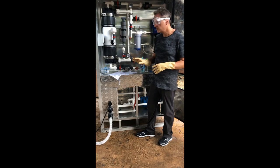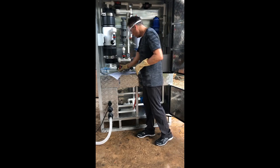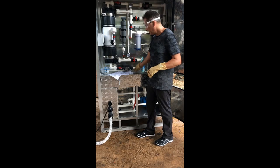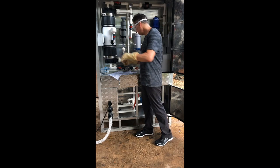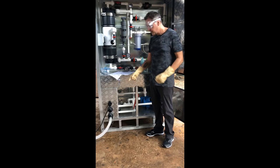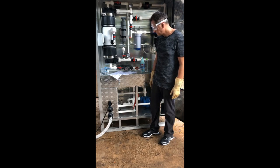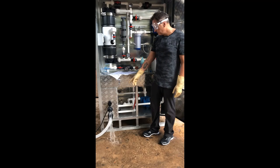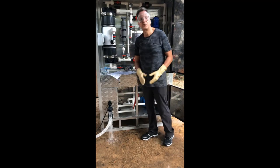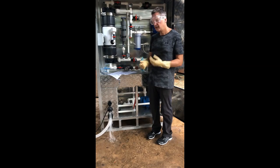The first processes here are to open three valves: number 1, number 9, and number 10. Then start the pump. You can see coming out of back flush connection number 8 the water that's flushing out of the filter. We flush for three minutes using clean water coming through the filter to make sure we get the membrane clean.